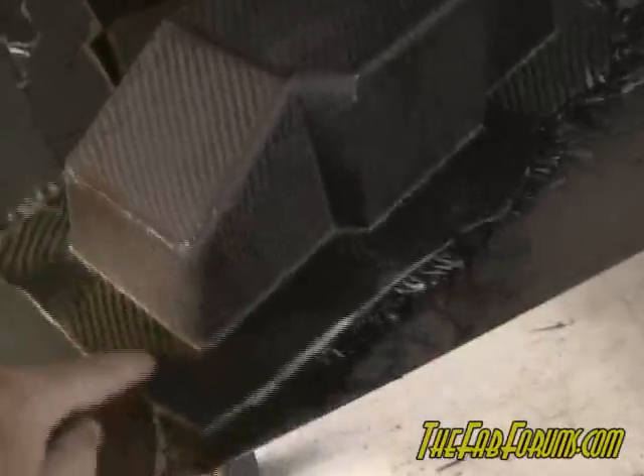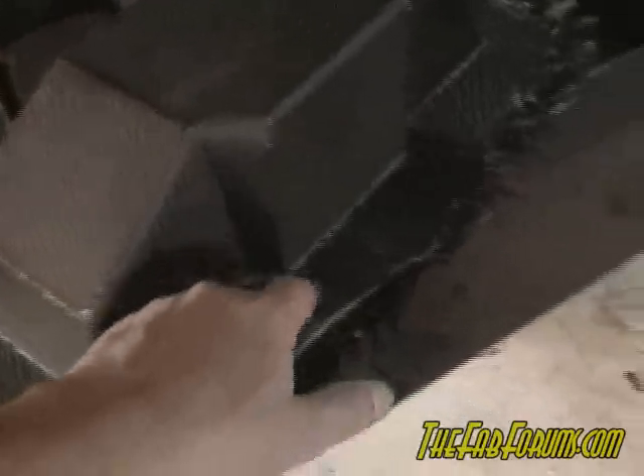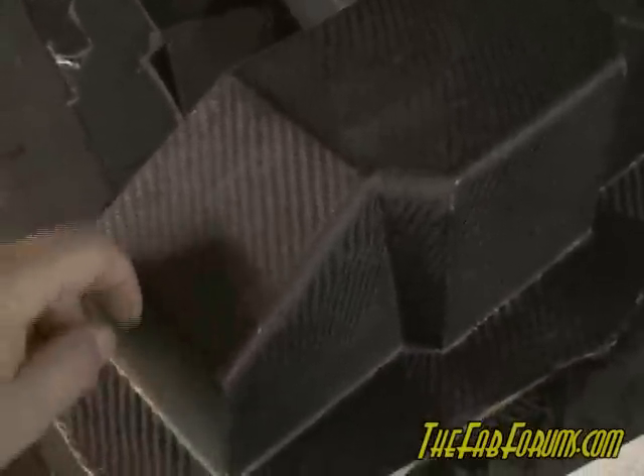You can see it's got a nice flange on it around the edge. We'll trim it back — depending on what we do, we may bolt it all around for a two-piece deal, or if we end up bonding it with a two-part adhesive I won't need much flange at all. It's got a little cleanup needed — some extra resin here and the fiber is down a little bit, but no big deal. We'll contour that curve and water sand it. This thing is solid as a rock. I put a little custom logo built right in there so nobody can ever claim it.